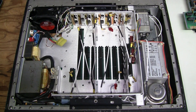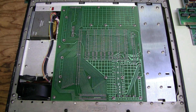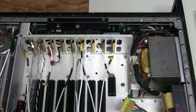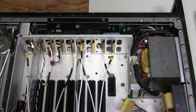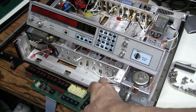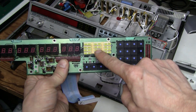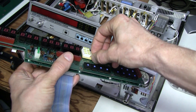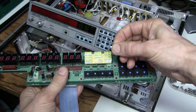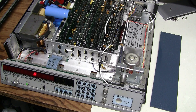There you go — I took out all the boards. This is the bottom of the unit with the interconnect board. I still don't see how I can take out the front panel board. I finally managed to remove the front panel with the boards — it turns out to be a sandwich of two boards. This block of LEDs that did not light up — look at them, they are sitting in sockets. It seems like it was just a matter of bad connection somewhere. I reconnected the connectors between the boards and reseated the driving chip in its socket, put everything back together, and it works fine.